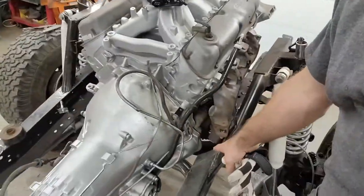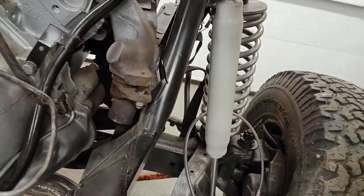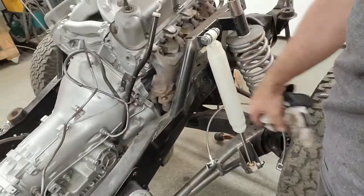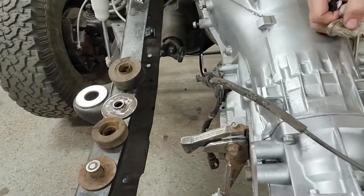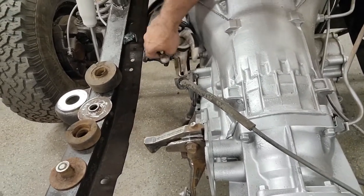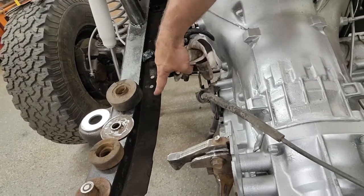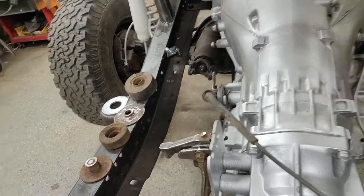The exhaust is pretty tricky. We've got to remove a little bit more frame in here, and maybe add some more reinforcement there. For the drive shaft on the passenger side, it's going to get pretty tight — pretty sure I'll be trimming some of this. When you're at full stuff and you bring that up, it moves inboard a little bit, so it shouldn't have to remove much, but I'll want to add some kind of reinforcement member.